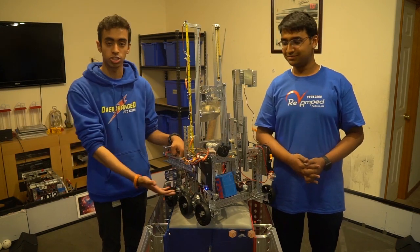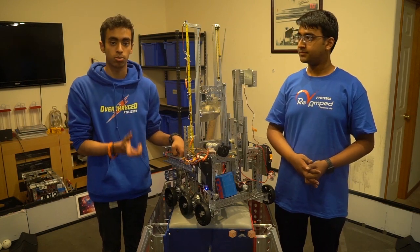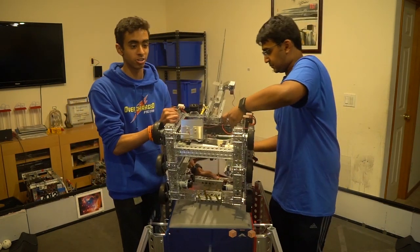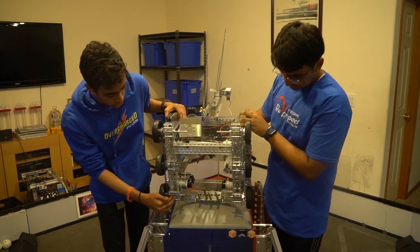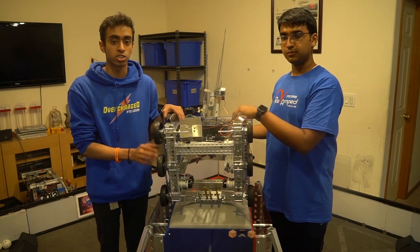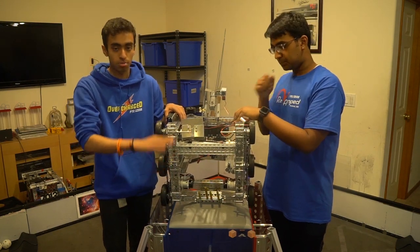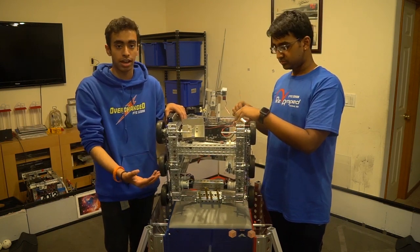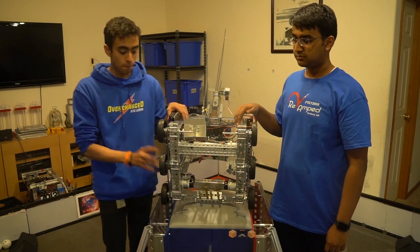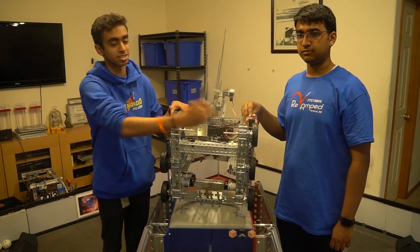One of the questions was specifically about the six wheel drive — how advantageous is the drop center we decided to use? Like I mentioned, the drop center is based on Actobotics parts, so you can find these parts easily. This right here is that bottom-tapped 1/4-inch bore pillow block we used. It provided us with that 3/16-inch drop, which was quite advantageous — if everything were in the same plane, when getting over the first part of the crater rim, the only wheels that would have contact would be the front and back, and the middle wouldn't touch. With the middle wheel dropped down a bit lower, we get that grip to power the back wheel and get fully inside the crater.